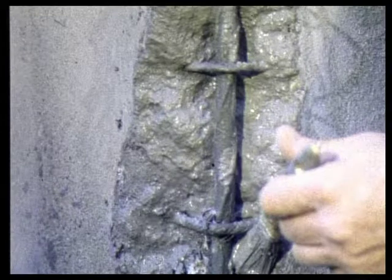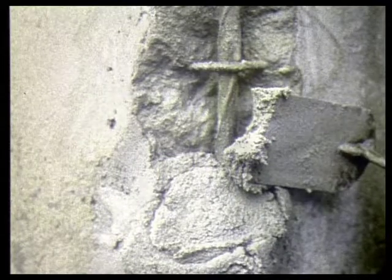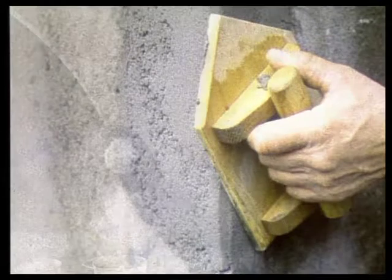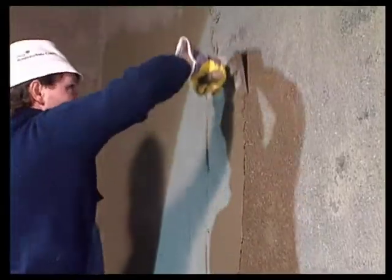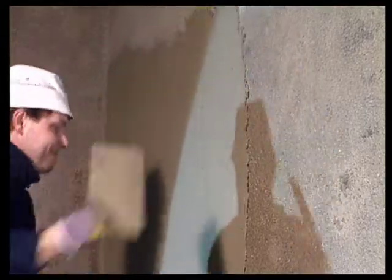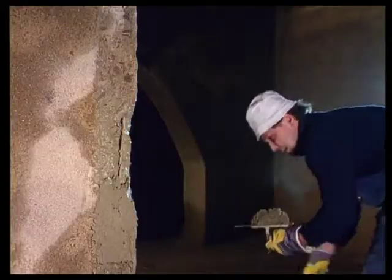And while it's still tacky, reprofiling of broken out concrete parts using Vandex Uni Mortar 1, followed by surface smoothing. If necessary, providing additional rebar concrete cover by coating partial or total areas with Vandex Uni Mortar 1, 8 to 15 millimeters thick, or reprofiling of scalings and repairs of concrete on floors, walls, or columns.